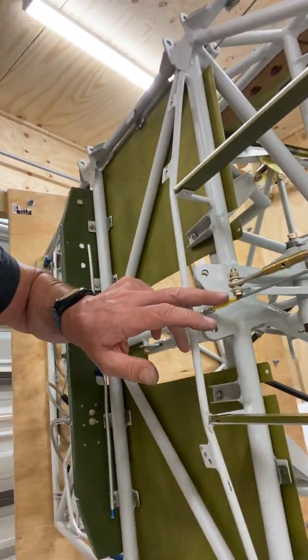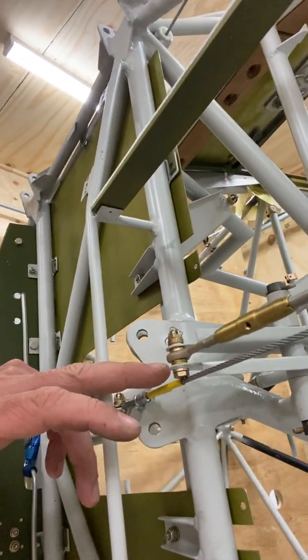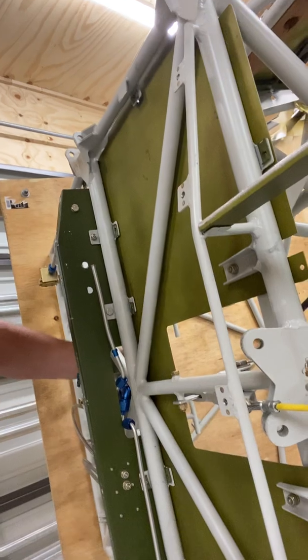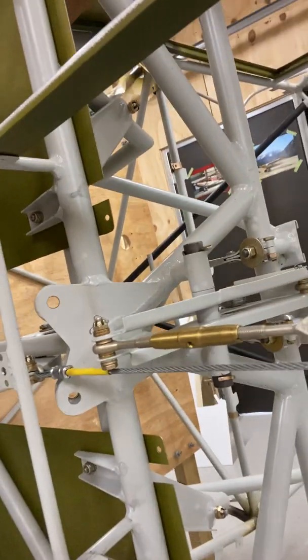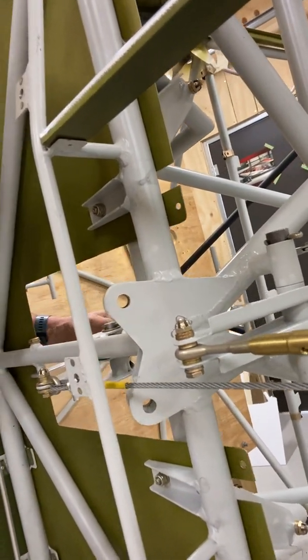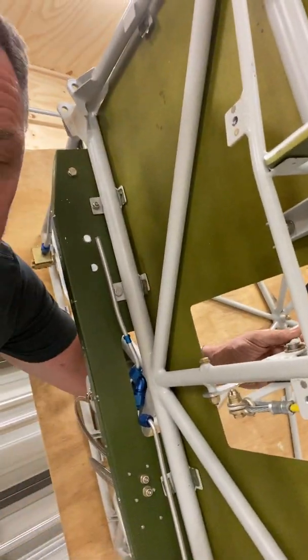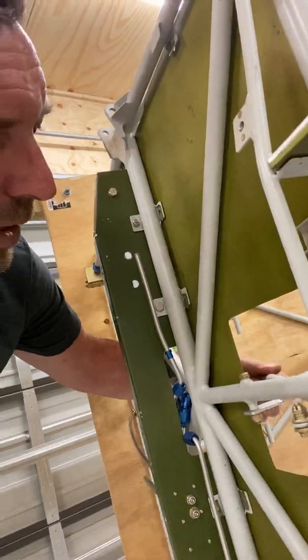You can see there's minimal clearance here from the flap cable. It's actually only in the flap retracted position, because if I move the flap lever you can see pretty quickly it gets adequate clearance in there. So we're going to play around with that and have a look.